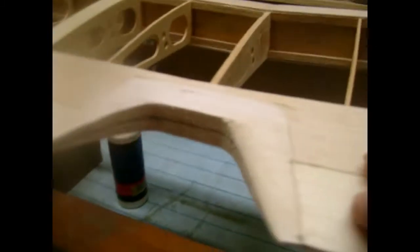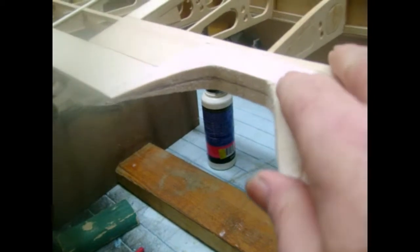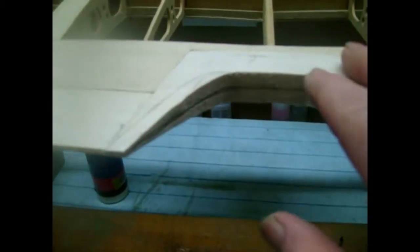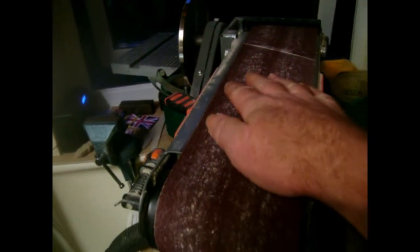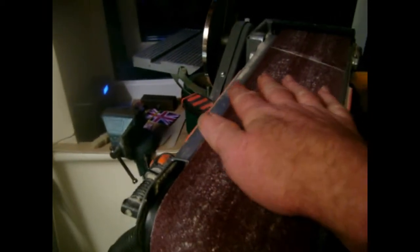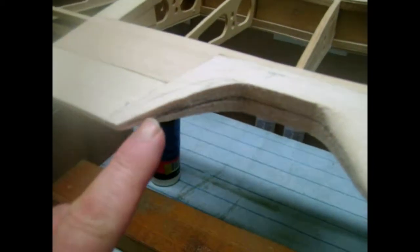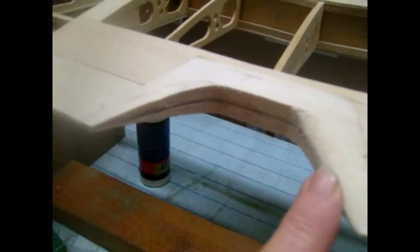Obviously, as you can see with this light, it's in, glued tight. Now, Ian, another way, because you bought one of these, I think: as I said earlier, cut it. But what you could do instead, like I did, I cheated. I got on the flat belt sander, and where I marked the lines in the last video, I just sanded it flat to the lines, because it's quicker and a lot easier. So you've got them in line, and then I drew a black line down the center, over there, to give myself a guide.